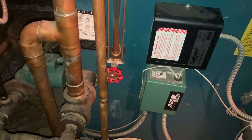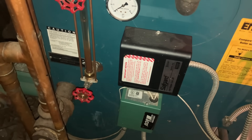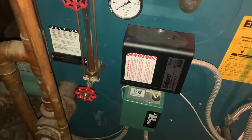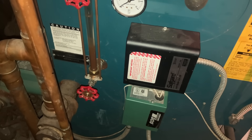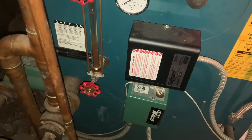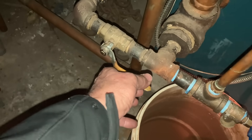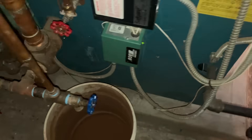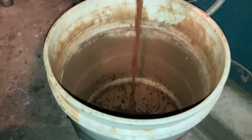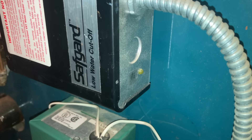All right, let me close the stops. It used to drain all the way down but it seems to be stopping more or less when it gets about there. It's dirty when you fill it. Yeah. Well, it runs out of water — how often? It depends on how hard it's working, like once a month, maybe once a week in the coldest weather. Can we close this valve? I want to drain some of the water. I want the low water cut-off to come on — drain until the light comes on, and then we'll do the rest.